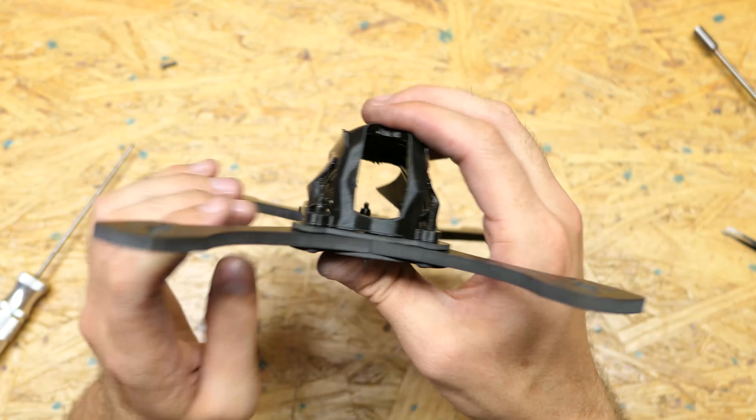We're still exploring the pod issue. We thought about getting it injection molded, we thought about polycarbonate material — we're still exploring it. I kind of prefer to have some give when you hit something so it bounces. So let's take a look at the weight. This is with 5mm arms that we're probably going to end up going with. We may go with 4mm — I haven't broken a 4mm arm, but I have broken a 3mm arm. Where most people break their arms is right across those two holes. Lately I've been seeing people drop one of the motor mounting holes, which is actually really clever — it gives you a lot more carbon strength there.